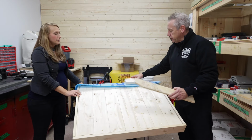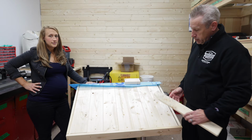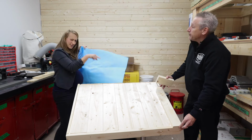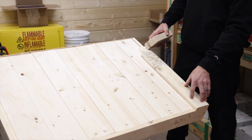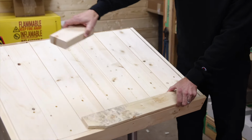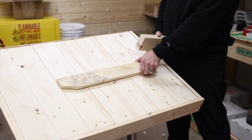Basically, with any strapping choice you make, you want to picture frame the exterior first. So if you're looking up here, just take this off so you can see the ridge. You guys all know this goes first, this goes second. Your strap will start down the corner, work your way up to the ridge, over the top. Then you put the next set of strapping right in here, the entire perimeter. Then from the perimeter, you infill, and we recommend 2-foot centers.